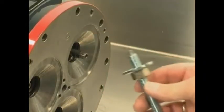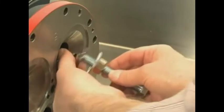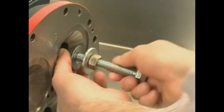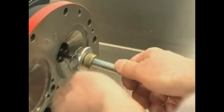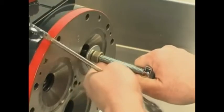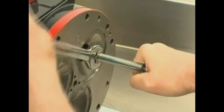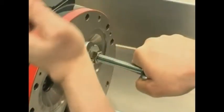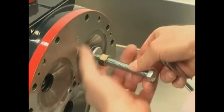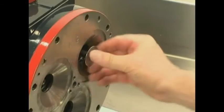Place a plunger on the exposed screw end of the plunger guide tool from the Wanner Toolkit. The large diameter side of the plunger should face the tool. Screw the guide with the plunger into the valve plunger until tight. Hold the top bolt of the tool and turn the bottom nut down to force the plunger to seat on the valve plunger. This is a press fit. When installed, the plunger should be tight against the shoulder of the valve plunger. Repeat this process on the other valve plungers.